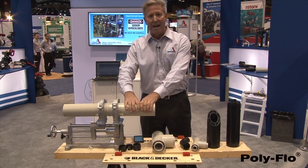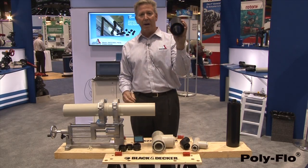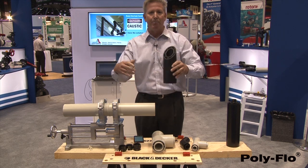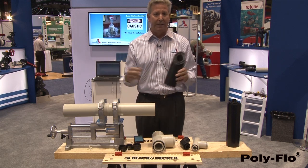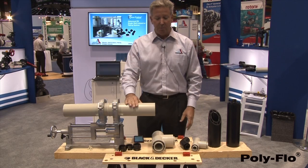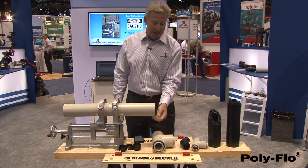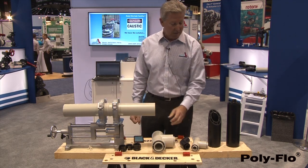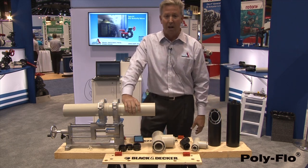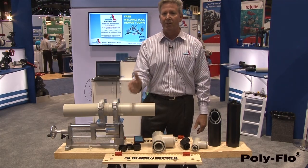So it's an automatically anchored system. This material you could actually direct bury in an open trench and put the same aggregate that you took out of the trench back on the pipe — you don't need clean fill. The polypropylene, you would need clean fill. This system is good for pressure and for drainage. It's rated for 150 PSI carrier and 90 PSI containment. That's both the polyethylene Chem Proline system as well as the polypropylene system.